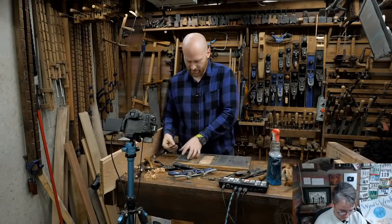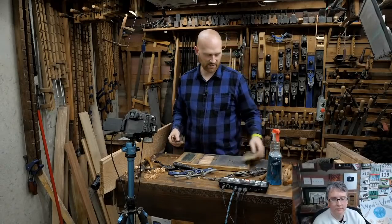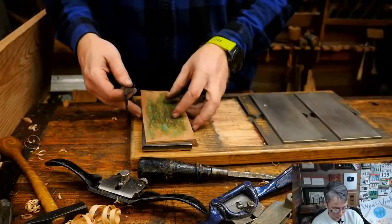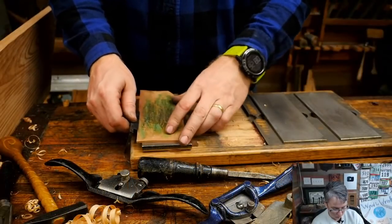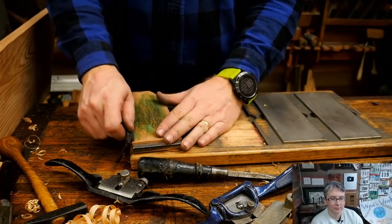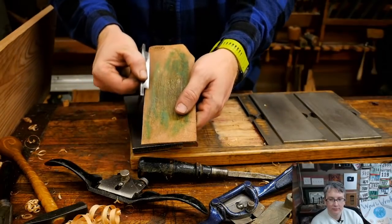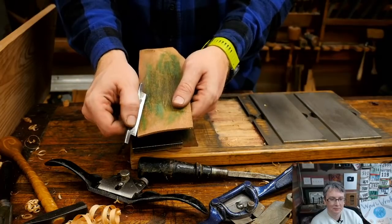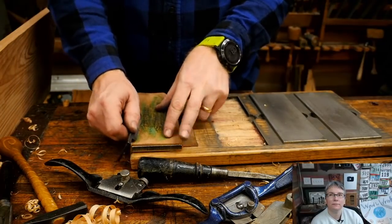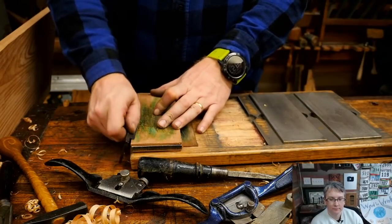There we go. And then the stropping on this one, because my strop is locked down, I'm actually just going to keep a strop on here, and I can do the same thing as putting the strop right on the side here. On this one, I want to have it overhanging the side because I want to pull it a little bit. If I go straight across, my blade could actually slice it. So I want to keep it at a slight angle like this and pull it so I'm pulling back across the cross rather than right along it.